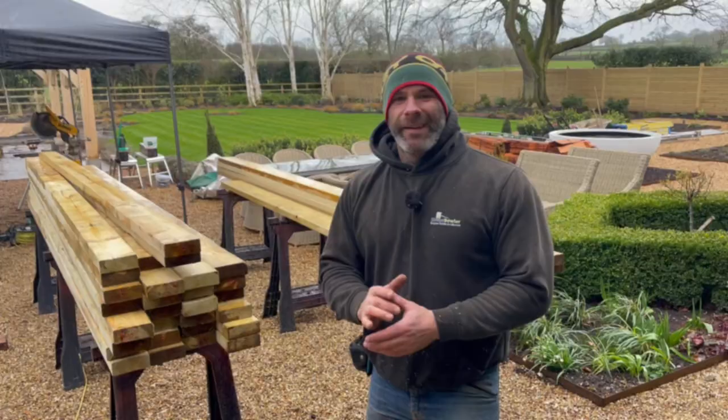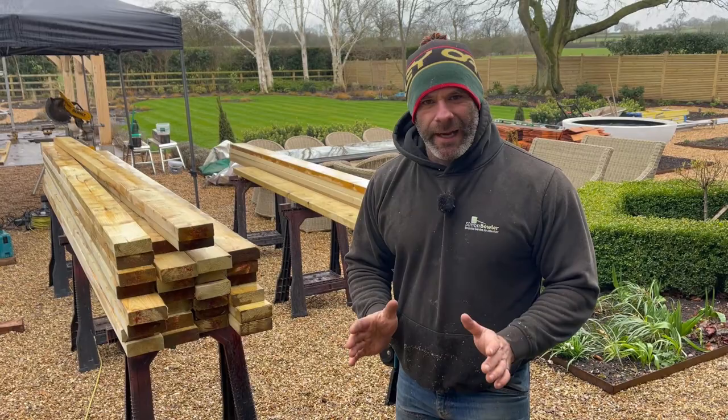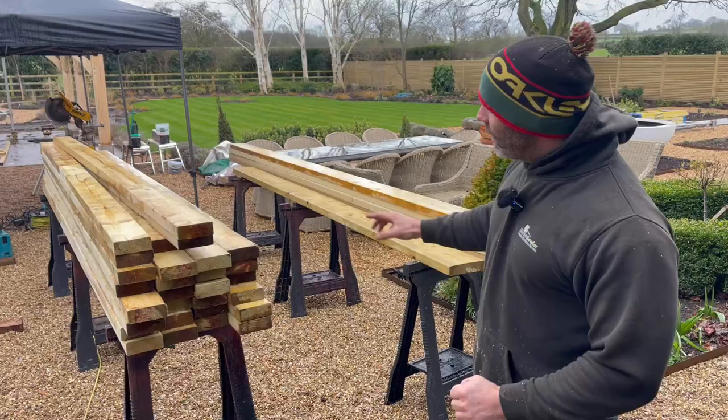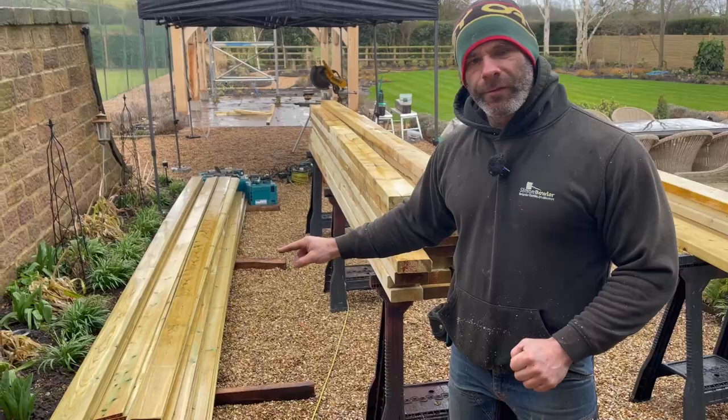New day today and typically it's raining. Anyway, we have to carry on — the roofing material has just turned up. These are the hip rafters and the ridge, 7x2 and 8x2 respectively. These are the rest of the rafters — they are 5x2 — and on the floor is the tongue and groove which we use to cover the rafters up from above. Now we can move on to looking at how we set the roof out.